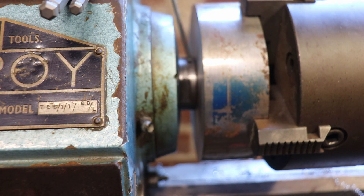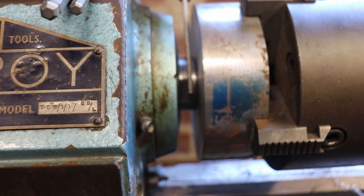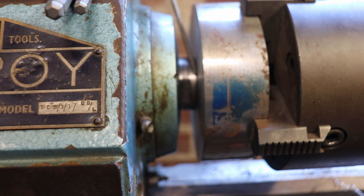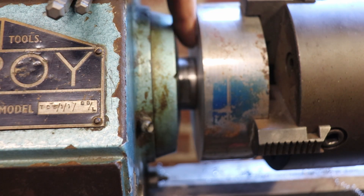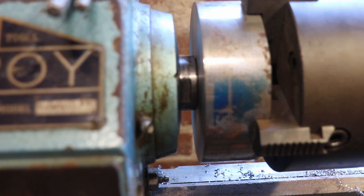She's gone over the lip, but there is a small gap just there. There's a gap here, so I'm going to deepen that bore out a bit, because I want it to back up against here and lock there. Your threads don't hold it concentric — it is absolutely spot-on on that turned shoulder, and then it locks up against the back of the spindle, so we'll deepen that.